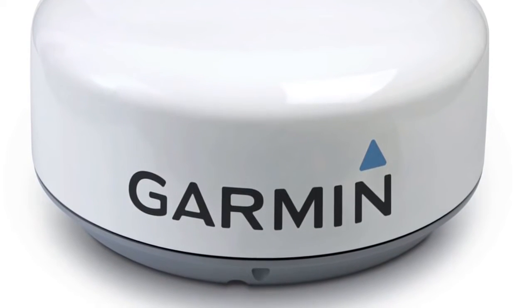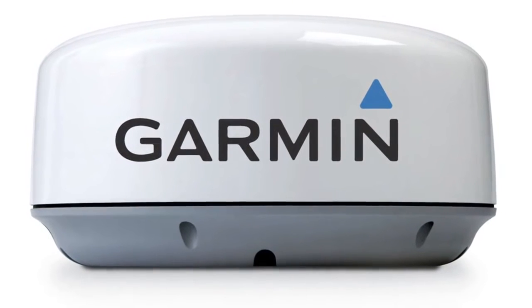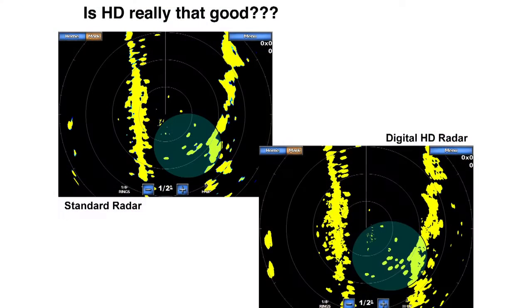Let's get back to Garmin radars. First up, our most economical radar, the GMR-18. This digital 18-inch radar dome delivers 4 kilowatts of power, a max display range of 36 nautical miles, and a beam width of 5 degrees, all for a very competitive price. The GMR-18 HD has the same specs — 4 kilowatts of power, 18-inch antenna, and 5-degree beam width — however, the HD stands for high definition. We've given the GMR-18 HD a much faster digital signal processor, which allows the antenna to crunch much more incoming data and turn all that extra data into more radar targets and better target resolution. One boat with two radars mounted at the same time entering a mooring field — exact same conditions, exact same settings — these screenshots tell it all. The picture on the right is from the HD version, which clearly separates the boats in the mooring field and draws a much more detailed radar image, thanks to its faster computer.